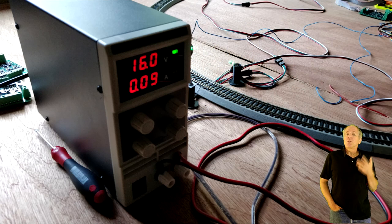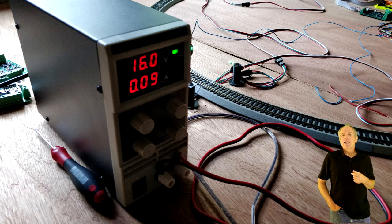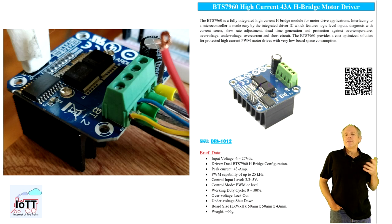The IBT2 is powered from a DC power source. I am using a standard DC power supply that can output about 10A. The IBT2 can theoretically handle up to about 50A, but since this is going to be a DCC command station and not a welding machine, it is a good idea to limit the maximum current to about 5 or 10A using the DCC++X current limit settings.